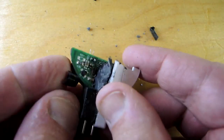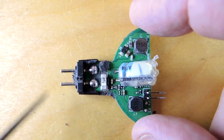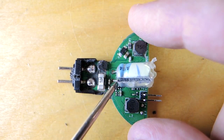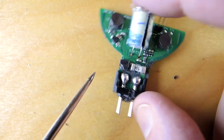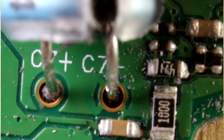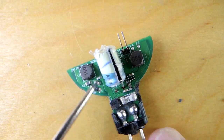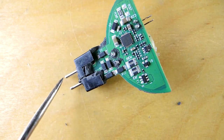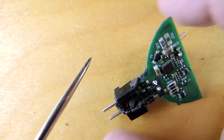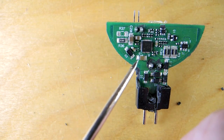Here's the circuit board with all the parts on it. The two pins are the 12 volt connector back to the socket of the bulb. There's a fuse here for safety and an inductor. A through-hole capacitor, undoubtedly for smoothing — for some reason they put it through some heat shrink before they potted it. A common theme in Philips bulbs is they never seem to let the solder run through the via, which is a workmanship issue — some high-reliability electronics guidelines always demand the solder goes through the via barrel for better service life. There are two inductors, and flipping it over we have four diodes providing bridge rectification, because it's always AC in on these bulbs. And then it looks like one integrated circuit, fairly sophisticated in terms of number of pins — we'll have to de-encapsulate that to see what's going on. The markings don't track back to any particular vendor.